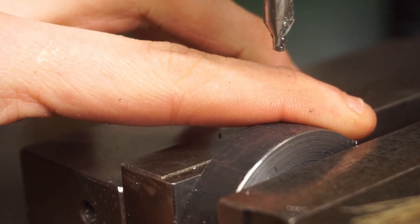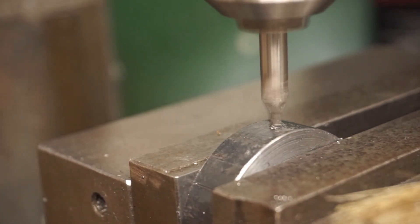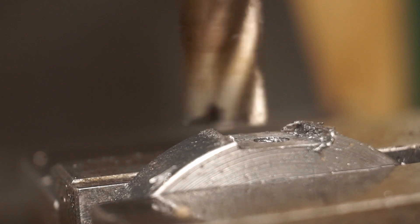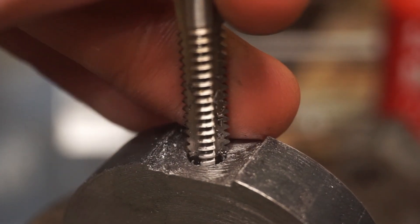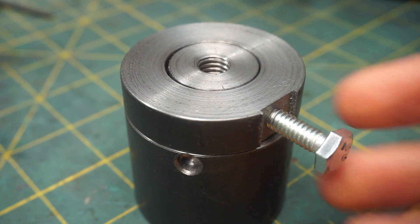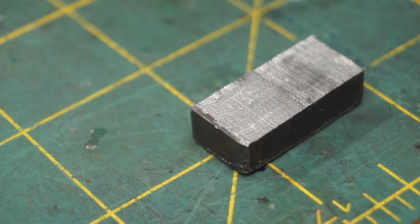So, this handles one side of the range of motion. But what about the other side? Well, I'm going to need an adjustable stop of some sort. If you haven't already guessed, this is the primary function of the ring. First off, I'll form a threaded hole. When a bolt at this hole is tightened, the ring should be locked into place. Second, I need to make this little pointer piece. This small chunk of steel will provide a stop that the plunger can run into.